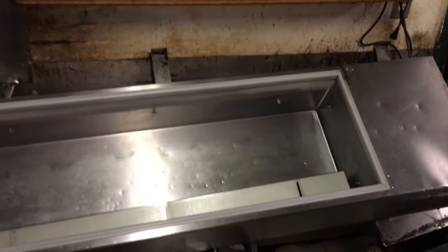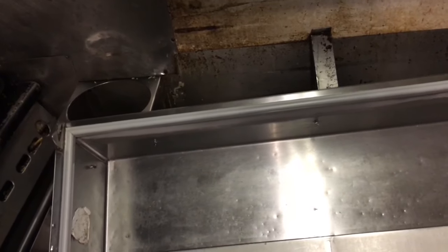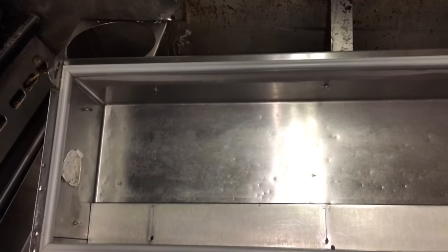We'll check our frost pattern — I've already got the coil, so we can leak check that whole section. And if there's a leak in the tubes here, party's over for this thing — that's all you can do for it. At the age of this, you're not going to be cutting stainless out with a grinder to look for a leak. This one's an old timer.